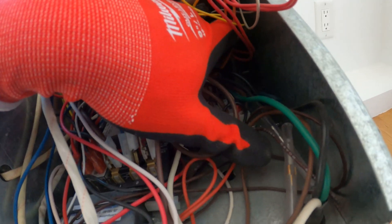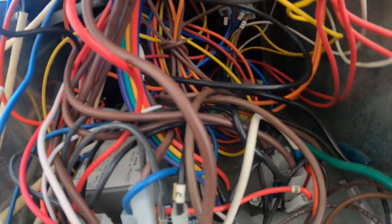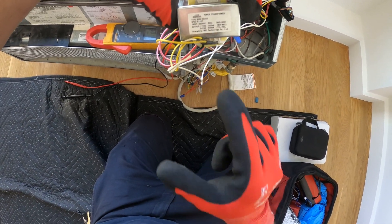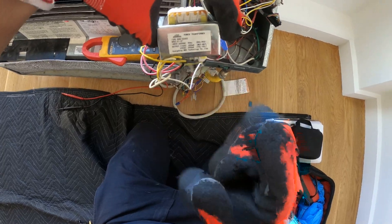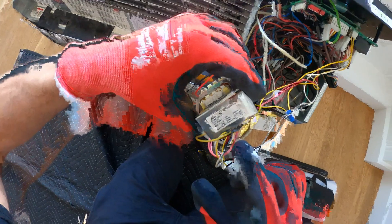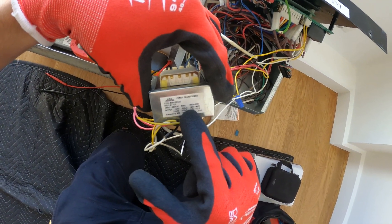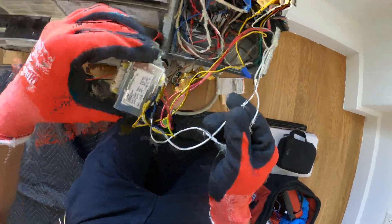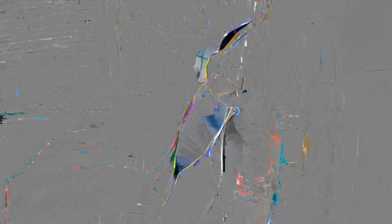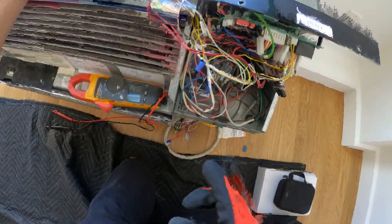Let's unplug that and get to the transformer. Honestly, these units are — I feel like they're harder to troubleshoot than most commercial units. The transformer's back there. Let's try to get those screws off and pull it out. All right, so I pulled out the transformer. Like I said, the input is 208 volts — that is our red wires going into the board. Then the white and white: between these two we're supposed to have 11 volts. And these two yellow wires — where I can see somebody cut at some point — are supposed to have 24 volts.